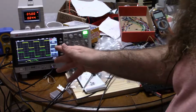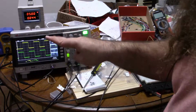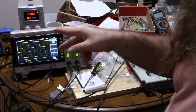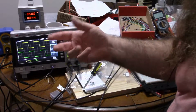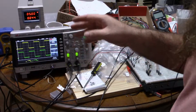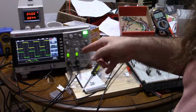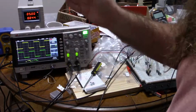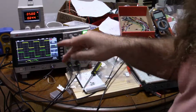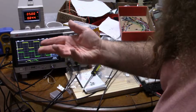And I'm thinking it might be connected to the fact that if I turn the base PNP to collector NPN resistor down all the way to zero, it's not a short circuit. Because at that point, there's single ohms of resistance throughout the whole thing, and it should be blowing through my power and current limiting, but it's not. It uses a whole lot more, but it's not a short circuit. So I'm thinking something about the transistor that makes that not a complete short circuit is also what's going on here. That maybe the load is affecting the collector to emitter, or rather, since it's PNP, emitter to collector, and that limitation is also somehow limiting the base to emitter, or, once again, emitter to base, since it's PNP. That is a subject for future study.